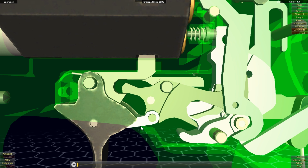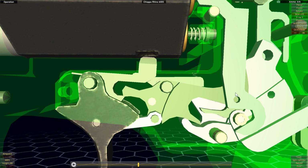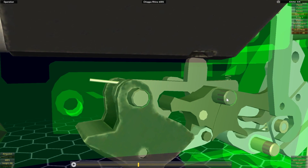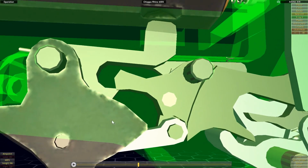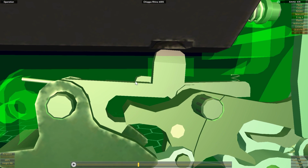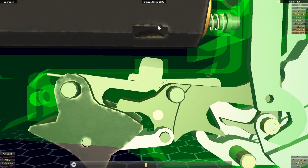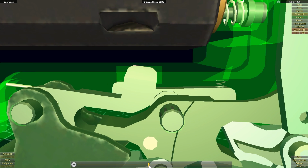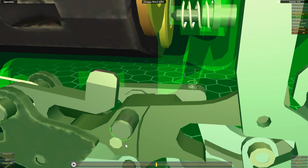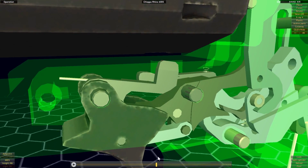So let's go ahead and take a look at what happens to the cylinder stop as the hammer is cocked back. So just like with the Smith & Wesson model we looked at earlier in this video, the trigger assembly here, as it pivots up on this end, it's going to pivot down on this end due to its attachment point with the frame here. So it's going to pivot along this axis point, pivoting up here, pivoting down here. And as it pivots down, it's going to pull down on this end of the cylinder stop, which in turn pivots along its attachment point here through the frame. So as it pivots down, it's going to fall out of the locking notch, allowing the cylinder to rotate. But eventually, this end of the trigger assembly is going to slide past as it pivots and off this ledge on the cylinder stop. Once that occurs, the return spring here of the cylinder stop will force the cylinder stop back up